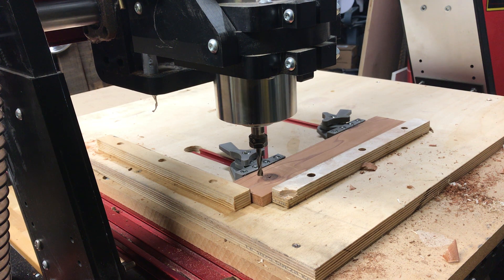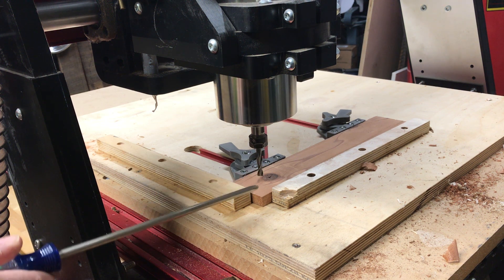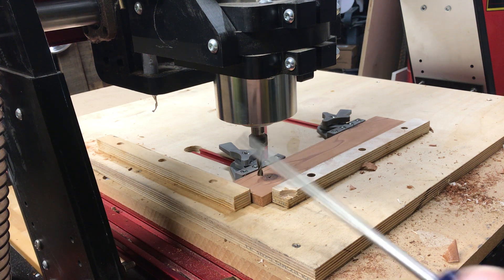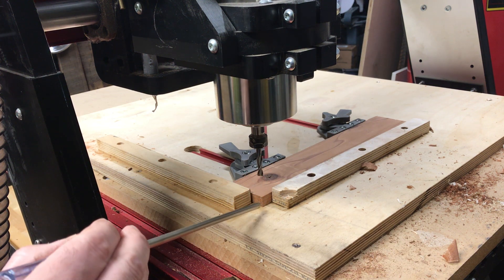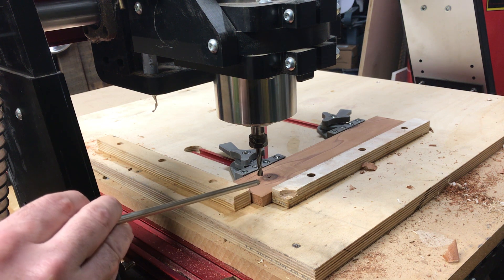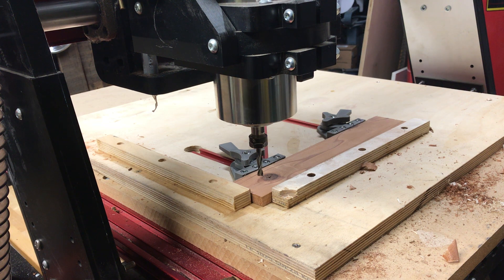I can make sure it's symmetrical side to side. What I want to point out is right now my cutter is at zero for my X-axis and zero for my Y-axis as well, because it's hovering exactly over this corner. I am one inch above this part because I'm going to run this program to make sure there are no errors or potential crashes that would break, at minimum, my part and my cutter, and it gives me the opportunity to check for errors.